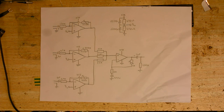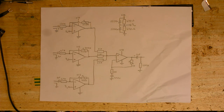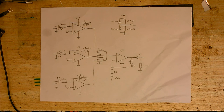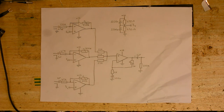Another thing you might have noticed is that while these two inputs have a 47kΩ resistor at the input, this one has a 220kΩ. This one is going to be connected to a valve circuit that I can switch in and out, so I'm going to need a very high input impedance — that explains that. I've also worked out what kind of capacitors I need for the full frequency range. I think I've waffled on about the circuit enough, so let's go and build something before I take another five minutes and waffle on about something else.